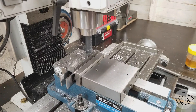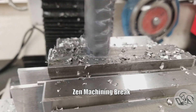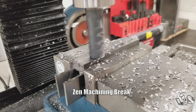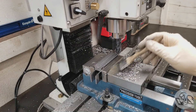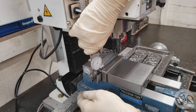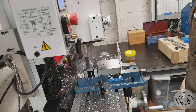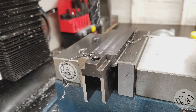Let's just take a moment to appreciate this lovely cutter chewing through some steel. We're going to clean up our tools here and we should have just enough left for a finishing pass. One more check to see where we're at on our dimension — we've got a few more thou to go, so I'm going to take that off in a finishing pass. Now we are on dimension for our prototype.